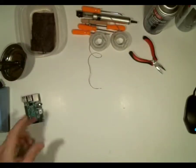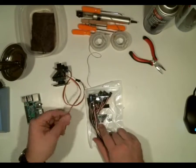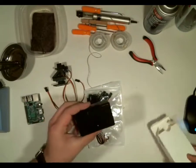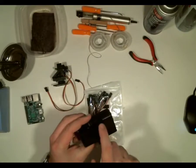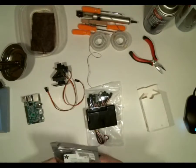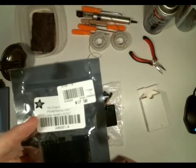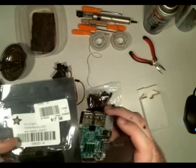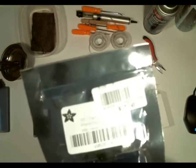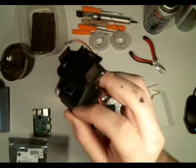I'm going to drive them with a Raspberry Pi. Let's talk about all the parts I got: some servo extension cables, a case for the Raspberry Pi with the GPIO port open on the top, and I got this from Micro Center — it's an Adafruit PWM hat for the Raspberry Pi. You just mount it to the top and it can control up to 16 different servos. One pan-tilt set uses two, so I could have eight sets of pan-tilt, which is great.